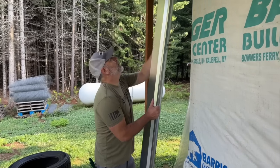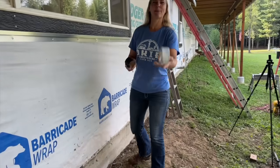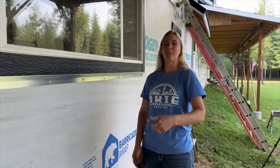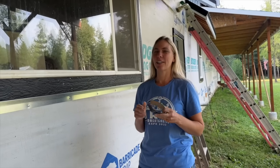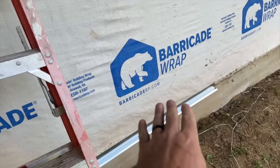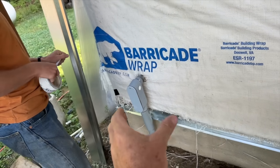I will put the cut end up into this little slot here because then you won't see it. Oh, thank you — your special tape! She found our special Tyvek tape. Colin's gonna put the tape on along here just to make sure we seal that up where that lower trim goes, and then we'll be able to start fitting the siding. We're gonna have to do some tricky work because we've got this penetration right here going through the house — I think we're gonna have to cut out a slot to slide it down and then slip a piece in underneath.